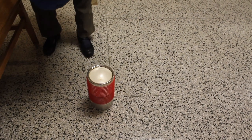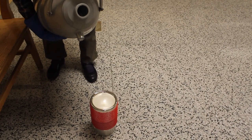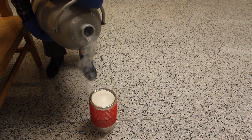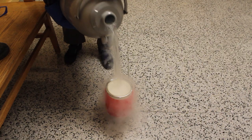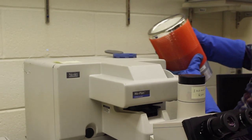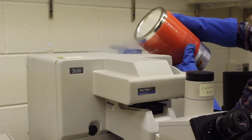You'll notice that I am not placing the larger dewar on the edge of the smaller dewar. I do not make contact with the smaller dewar because there's a chance that that might cause it to shatter. It's okay for the liquid nitrogen to spill over during the pouring.